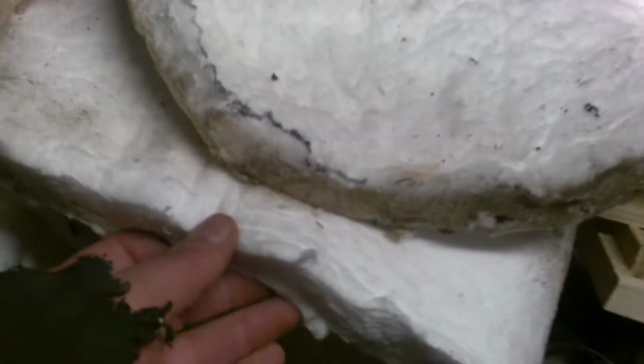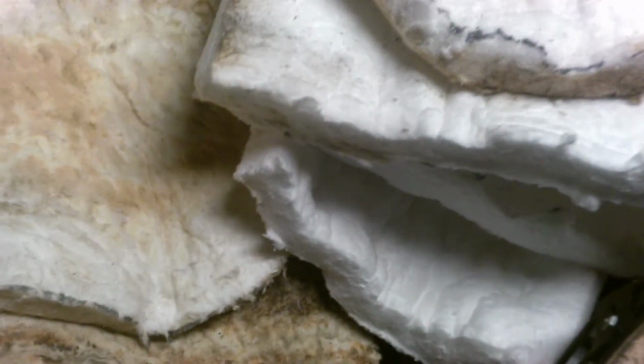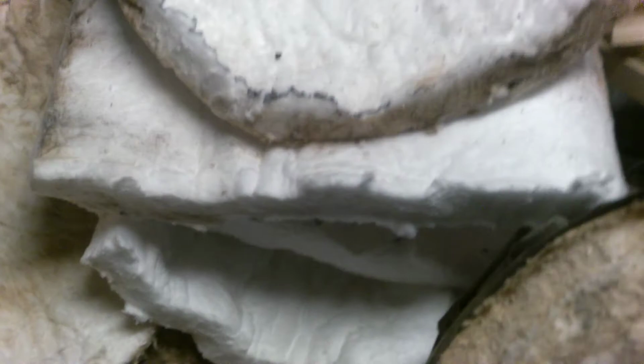Okay, right here is this new ceramic blanket. It's an inch thick. Over here is the old ceramic blanket. I got the new already cut. What I plan on doing is on the bottom of the foundry, put a little spray paint on it. I'll try to clean it up a little bit better, then put some spray paint on it, and put the ceramic blanket in it. And after I put the first inch in, I'm going to be putting the second inch in.